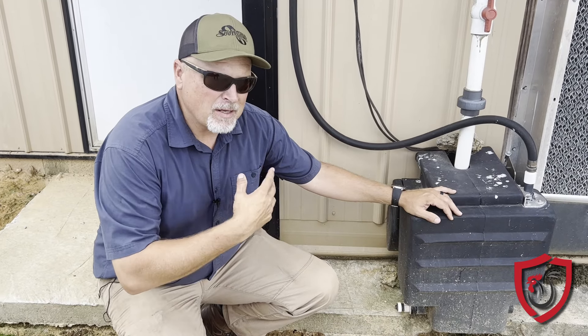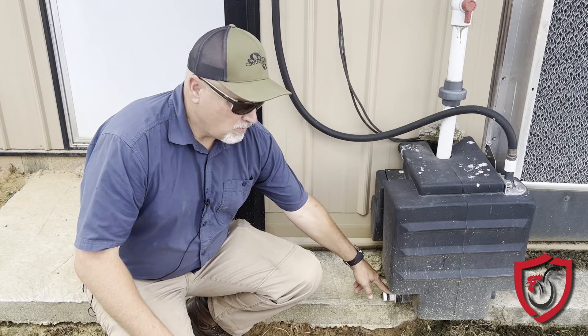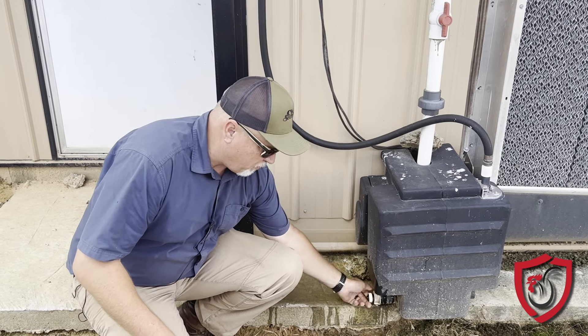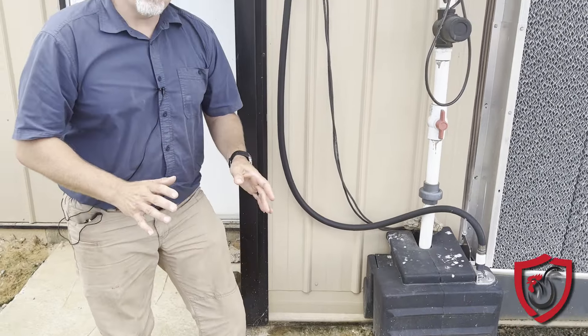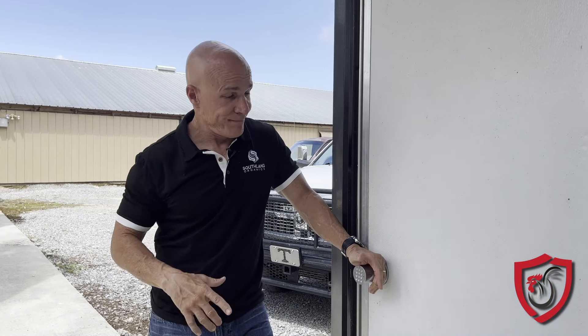I have a quick tip for you guys. If you happen to have a drain on your farm that you want to winterize — if your cool cells are like mine — you have an opportunity with a small drain plug on the side. I've come up with a method to drain my cool cells using a simple plumbing plug that I don't have to keep tools on hand for. I just pull that plug out and the water starts coming out, push it back in, tighten it up. No tools involved, super simple, very easy method of draining my cool cell tanks.